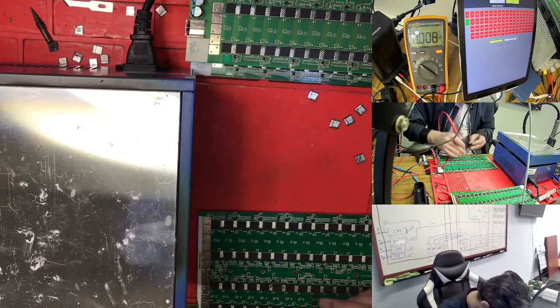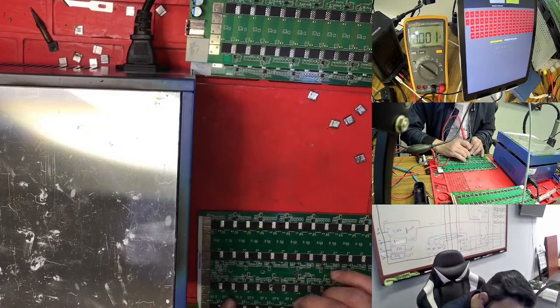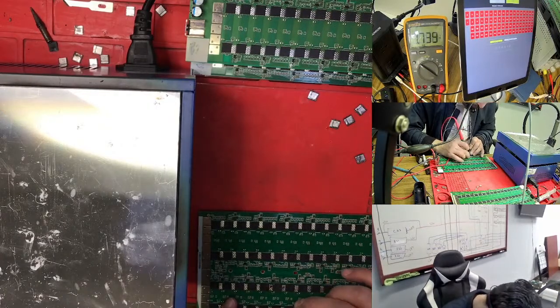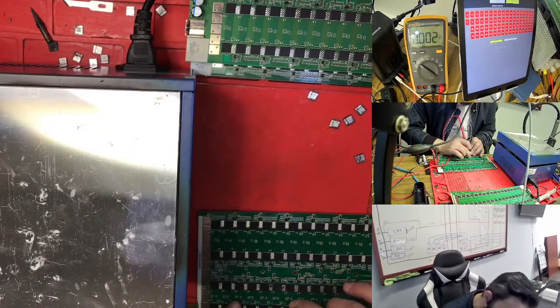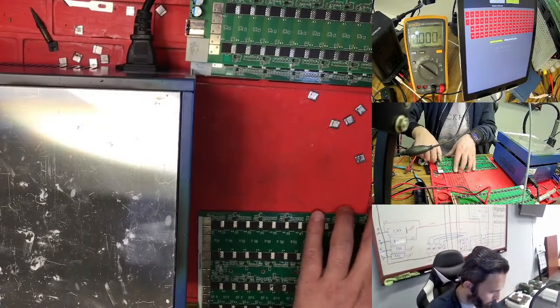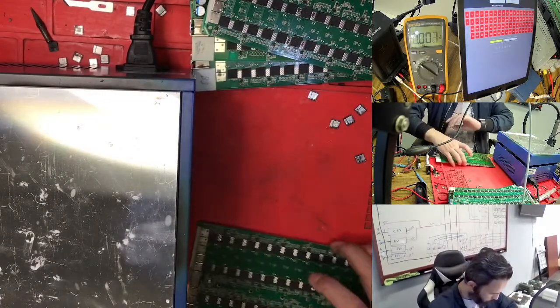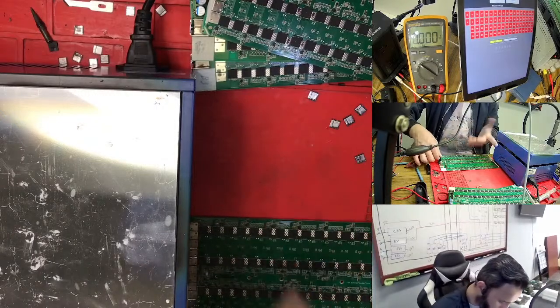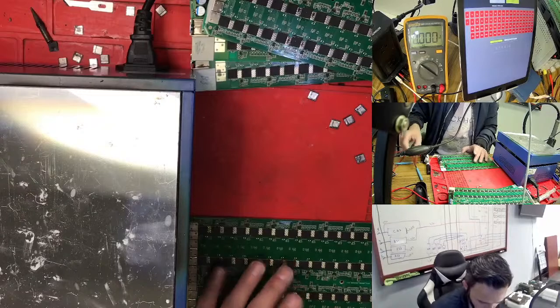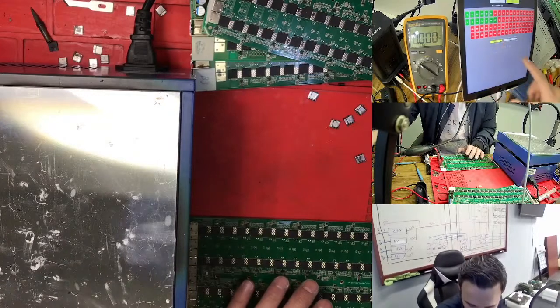So we have here, no. We don't have the value here. 1.7 here we have, but 9. So this one is good. So we just need to bring another hashboard. If we can find a chip that is green, we take it from this one to see. So we just confirm with one chip. If we get one chip, we mark one hashboard where it is blocking. So this is a very easy way to test.